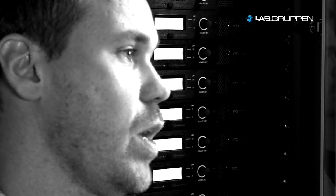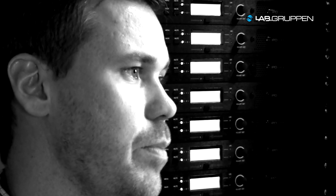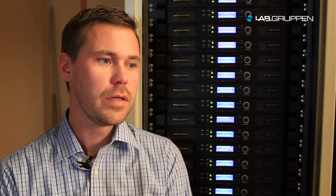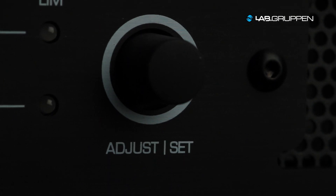One application where the input mixer can be of good use is, for instance, if you're mixing a band in the evening and then you have a DJ coming on later — when the DJ comes on you can have him plugged directly into the amps already. Another very important feature coming down from the PLM world is the IPD load library, where you can find many different types of speaker presets that you can download.